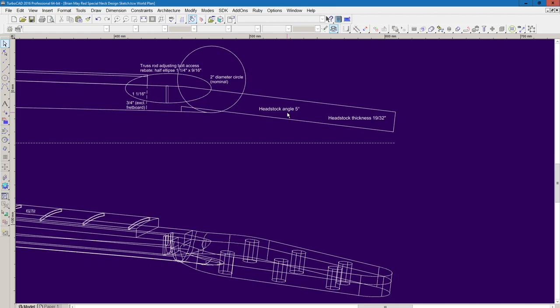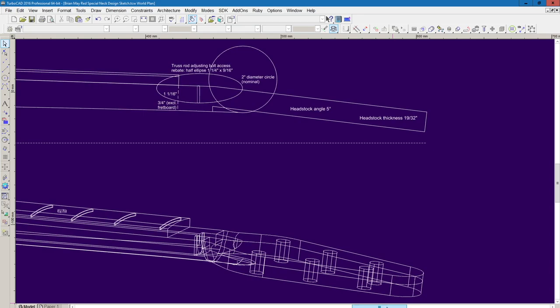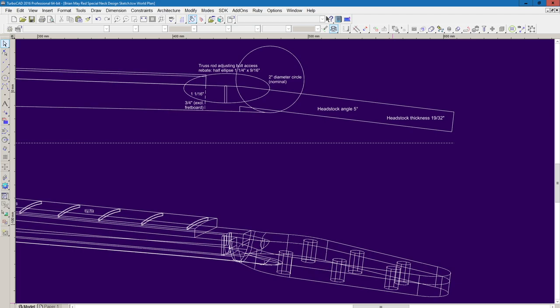I initially assumed that this was 4 degrees, but reviewing my 2004 Burns Special guitar, I found that the angle was 7 degrees against a horizontal main section. It seems to be generally accepted that the original Red Special neck pitch is 2 degrees, so this would leave us with a 5 degree angle to the headstock. I don't have any authoritative information here, so these seem like reasonable inferences.